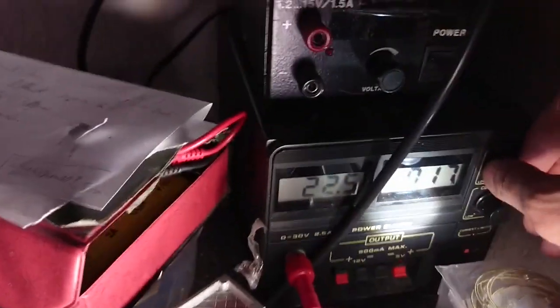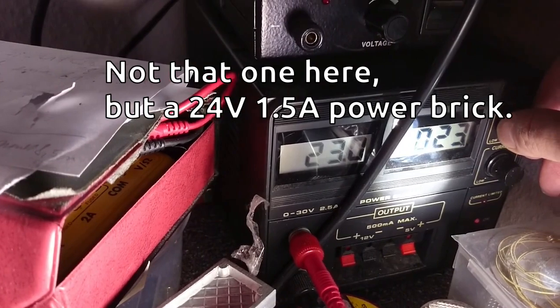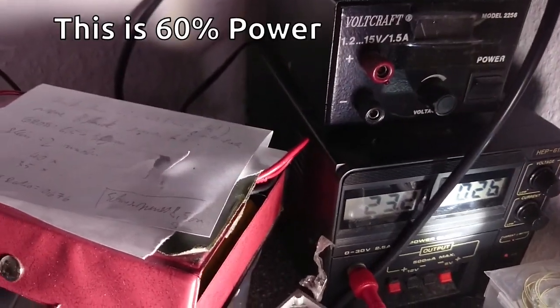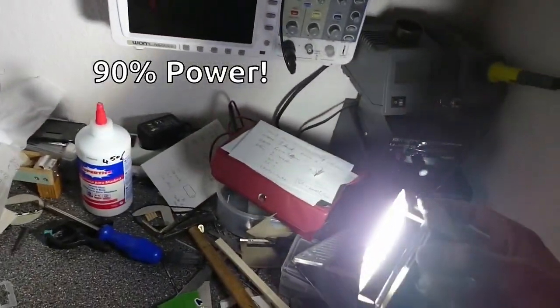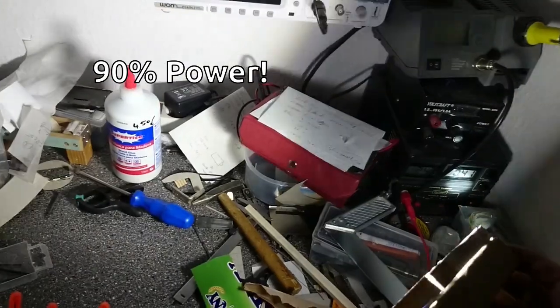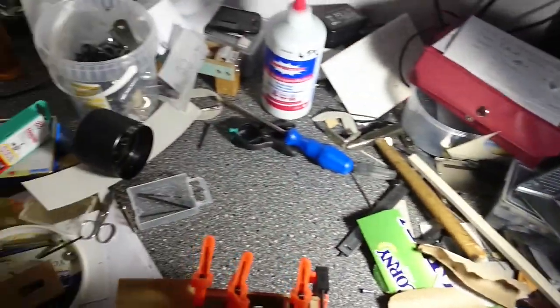I run all LED strips in series on a 24-volt power supply with a small dropper resistor. This is not optimal because resistors are a poor current control and usually the setup would need an electronic regulator. But it works well enough without one because the 450 milliamps that go through the lamp let the power supply drop the voltage a little bit, which in return reduces the current.